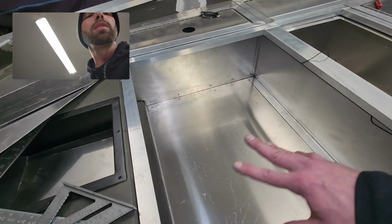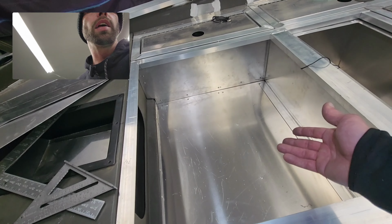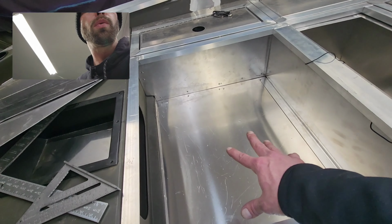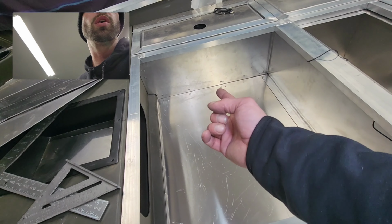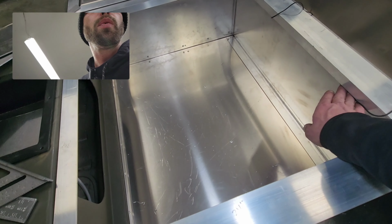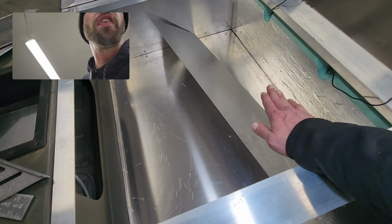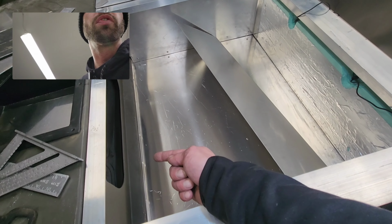And this is something you guys can do at home. If you need to figure out how to lay out your internal hatches, this is a good lesson for you, because I built the bottom one. It's a three-sided pan, one here, here, and on this side. I left this one raw. That way I have the ability to slide this one to make it fit the way I need it to fit up onto this front deck.